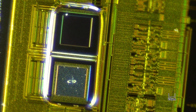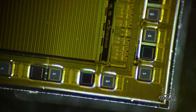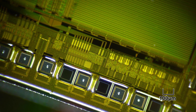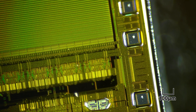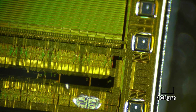Most of the square bond points on this chip are address or data lines. The 19 address lines are used to select which memory byte to read from, and the eight data lines are used to read out the data at that individual byte on the chip. This chip also contains a number of other tiny details that implement features like data buffering, address decoding, and control logic.